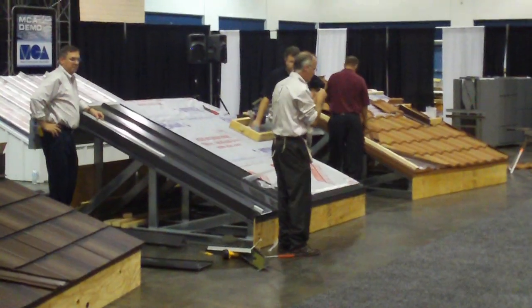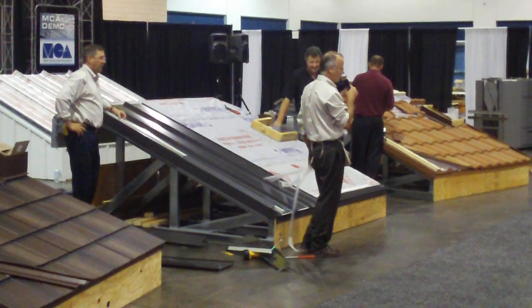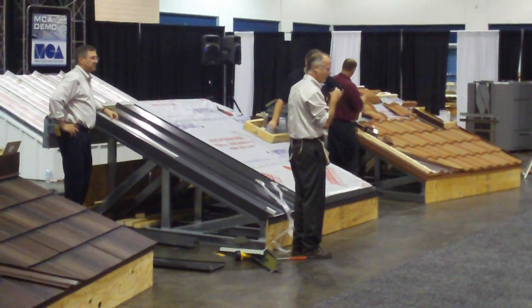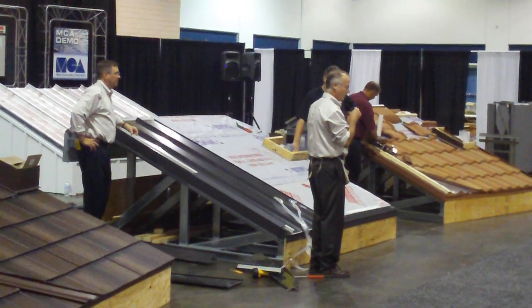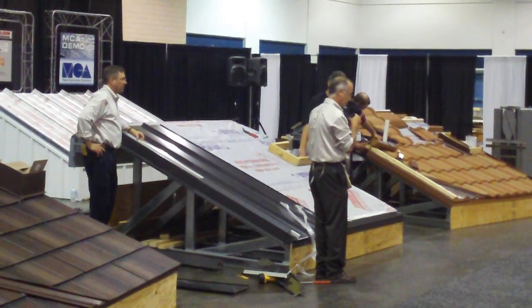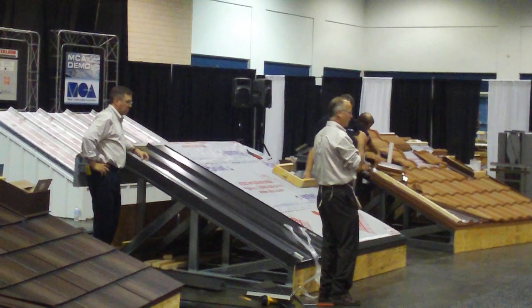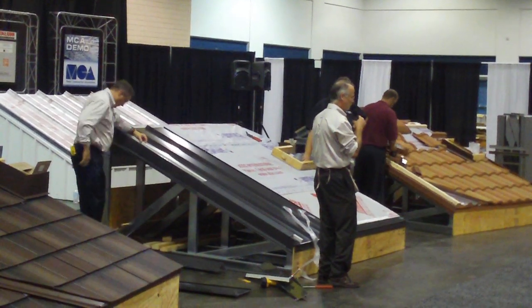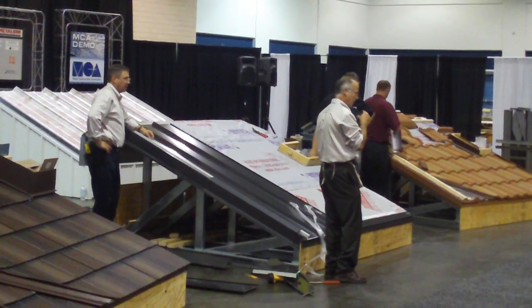you're going to get a call from your homeowner saying, something's wrong with my roof. I can see these funny looking cloudy stripes on it. They're going to call you back and you'll realize, oh geez, my guys forgot to get the masking off. And I always tell everybody, hope you have a good set of fingernails, because that's about what you're going to need to take that off, because it just won't pull off. There's nothing that I know of that's going to remove that. So always be aware. We get calls almost on a monthly basis, but there's always 1 or 2 a month where somebody forgot to pull the masking off. So it's typically on the trims as well as the panels themselves.